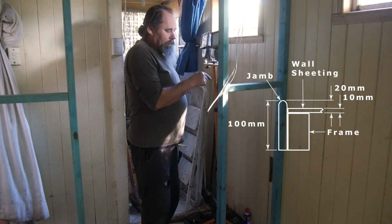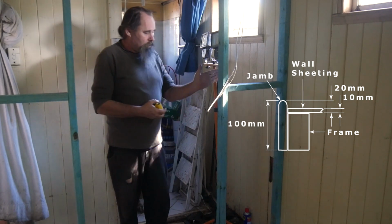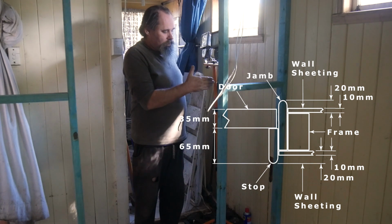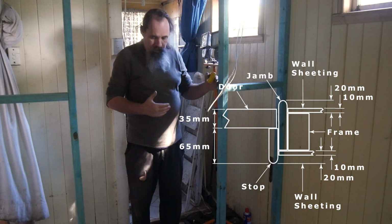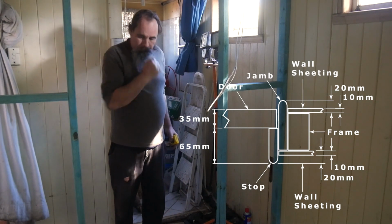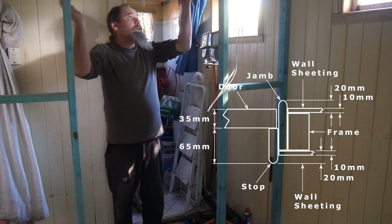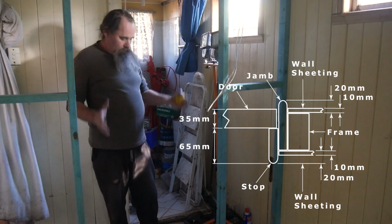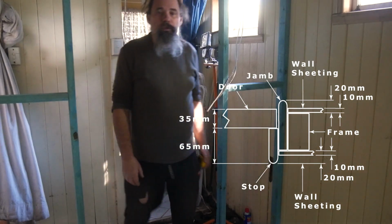and rounded on that edge, on this edge, and then another piece on the inside that sits where the door sits. The door will be opening this way. So basically you just got to cut those out to length, route the edges, and nail and glue it all together.